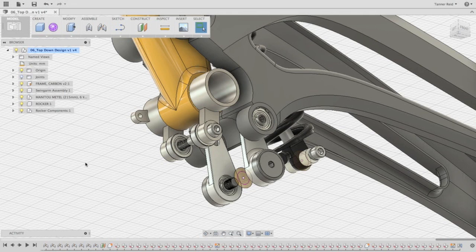Once you've opened the file, the first thing we want to do is edit the sketch that we have started here. You'll see a couple of circles there, and these circles align with the joints they'll be making with these pins. That line is purple in the middle on that first circle because it is connected to one of the circles from those pins. We projected a circle in there, and it's now defined by that relationship with the outside part. Purple means that it's connected to an outside piece and references that.